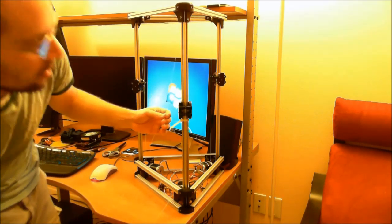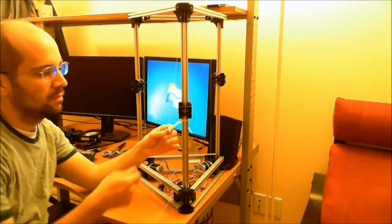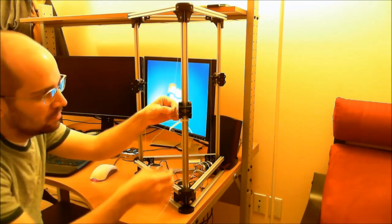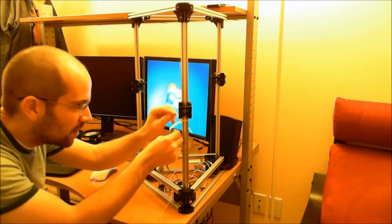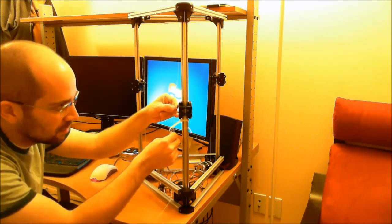I'm using a surgeon loop for these. I find it's easiest if you use a slip knot. It's hard to gauge how long this overall thing is going to be. When you do the surgeon knot, it's going to shorten by almost a centimeter or so. So I generally overshoot where I want to go by a centimeter.